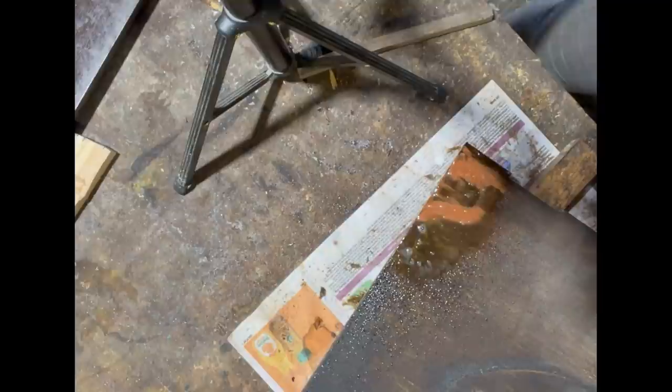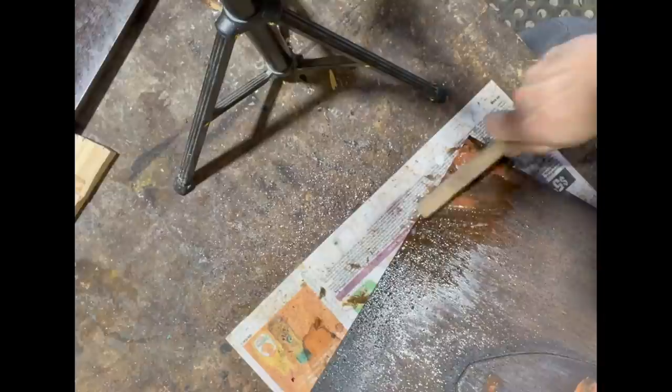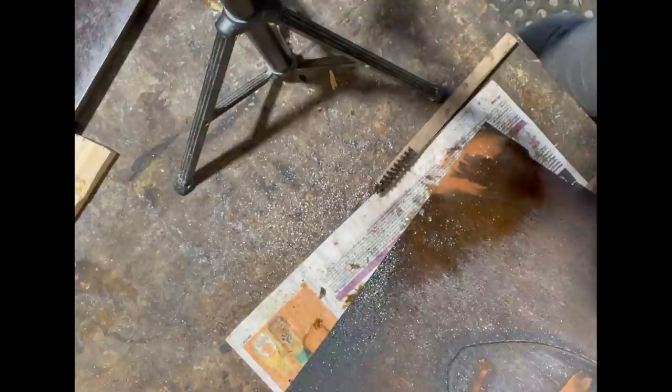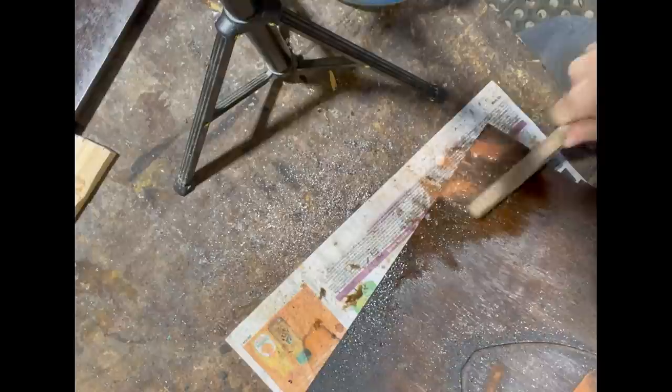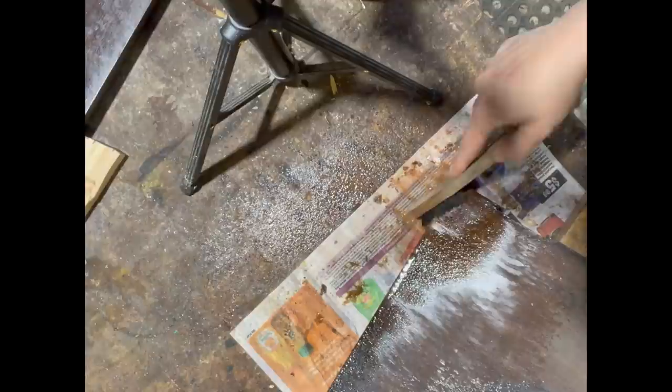All right, guys. So this area here, I can see that there's lifting veneer with putty everywhere. So what I'm going to do is soak this down and start scrubbing that off. I usually like to do my veneer repairs before I strip, and I can't do that if this is all over the place. So I've got to get this off and see what's going on. Looks like there's putty right underneath this veneer piece here too. I'm just going to gently scrub under there.